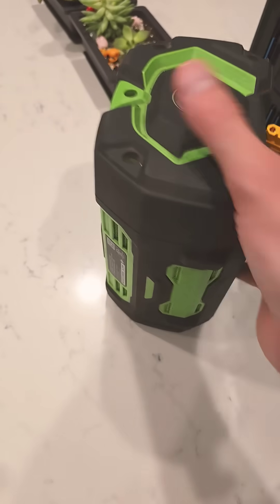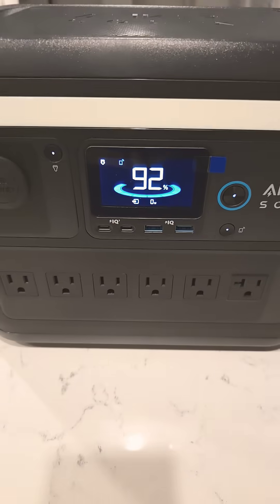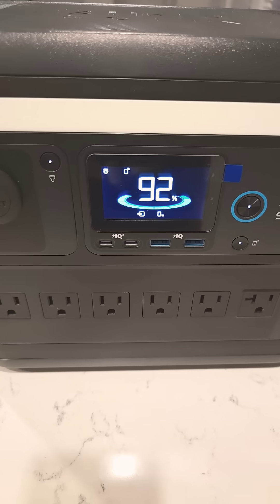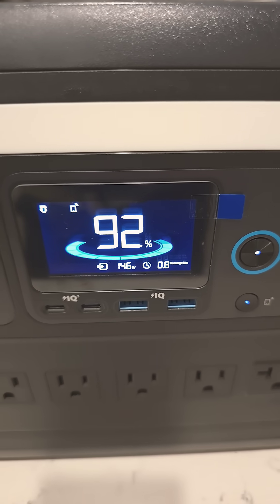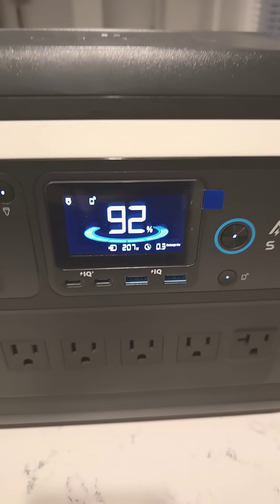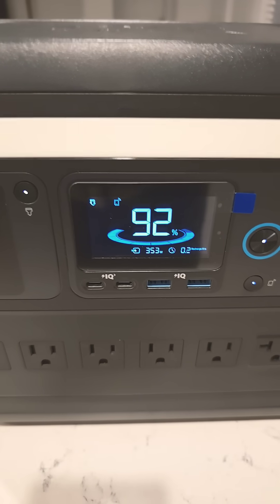Once you plug in, test your voltage and make sure you're below 60. Then you just plug that in there. As you can see, I've got one minute left — it clicks on and I didn't have to do anything. It is showing 83 watts input. If I don't get to the end of the video, it will actually go all the way up to almost 600 watts — like 584, I think is what I saw it peak at.